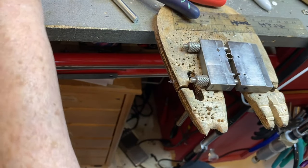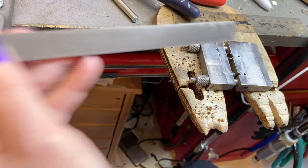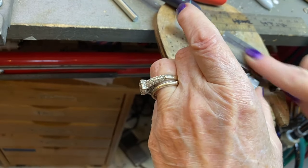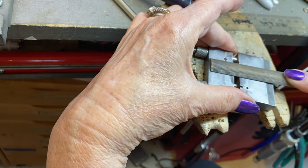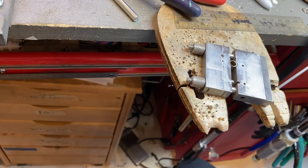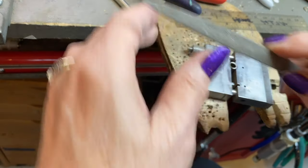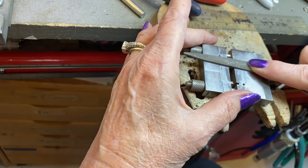What I'm going to do before I measure and cut this tubing is clean this end up and square it. We need a file — a little half round, double cut. It takes off material pretty quickly. I'm just going to file this down so it's flush. As I can see, there's a little uneven, weird surface there. And then I'm going to switch to a finer one. Remember, files only work on the push — every time I do this I'm picking up on the return. My hands are just trained to do it.